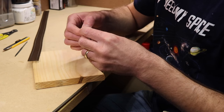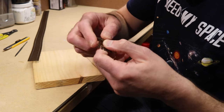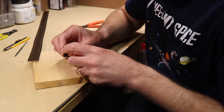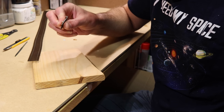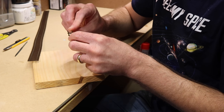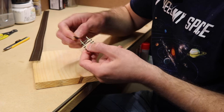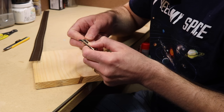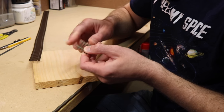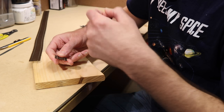Very easily you get a cut all the way through. I did actually leave a little bit on the bottom on this piece, but this gives you again a very nice smooth cut. Out of the three methods this probably produces the nicest cut in terms of needing the least amount of filing — it feels smooth to the fingers and I could probably just use it as is. I'll touch up the corners a little bit just to make sure there are no little burrs. This provides a very nice smooth cut; just don't do it too fast, let it go through smoothly.